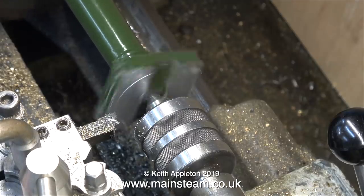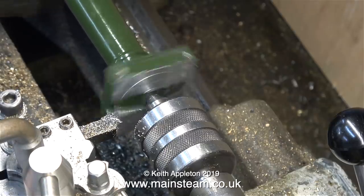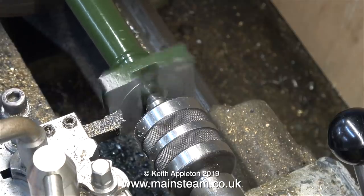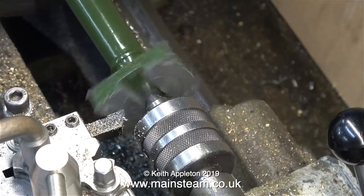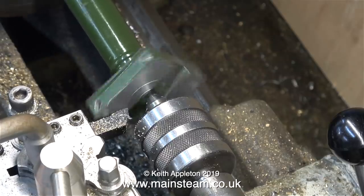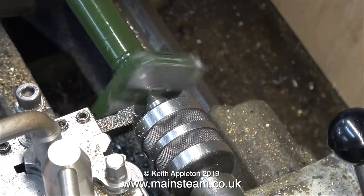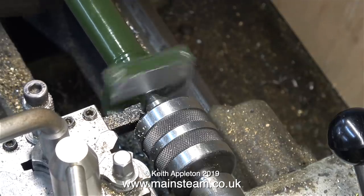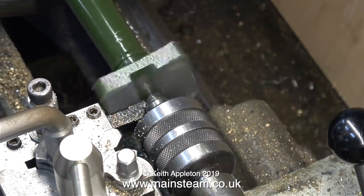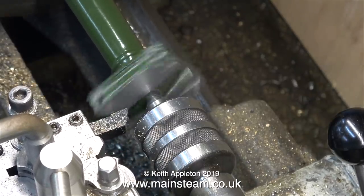I could have done this a much easier way — all I had to do was carefully cut off the bolt heads and then use the linisher to clean them off, then mount the bearings on top of the column. But there are already several holes in this column in the wrong place: four of them are now filled with metal from the bolts, and the other four are just filled with some sort of body filler. So I'm going to do it the hard way. I'm going to fit two metal plates on top of the column, through which the main bearings will be bolted down to the column, giving it added strength. At the moment I'm trying to get a perfectly flat surface to mount these metal plates.